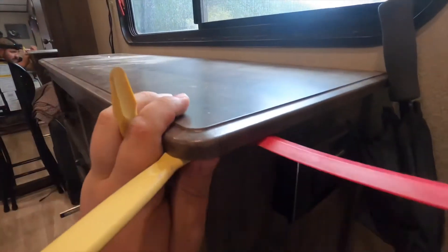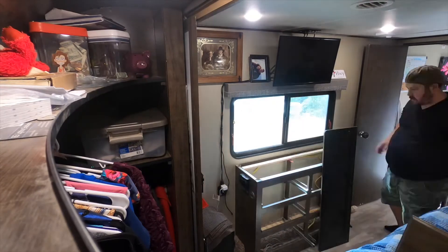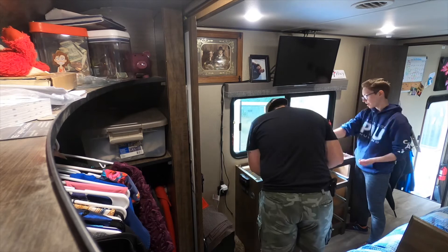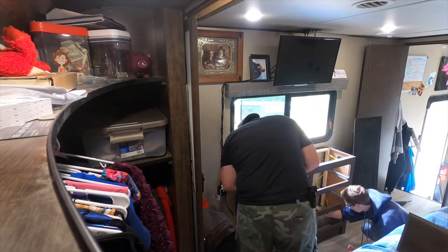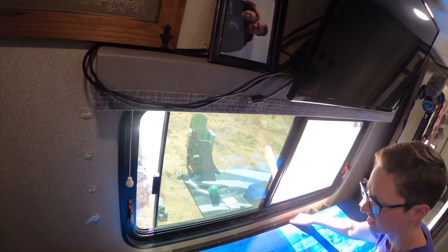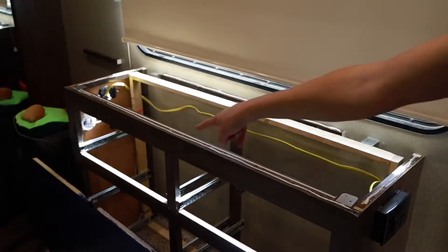Now the fun part begins — putting this desk together. The first thing I did was take off the old desktop. I wasn't sure exactly what this would entail since I'd never taken one off before, but I'm very thankful they only used long staples instead of glue. After you have the old top off, remove all the staples remaining because you won't be able to put the new top down flat. I used my Dremel with a grinder head to get all the staples off — it took maybe five minutes. Then I placed the new desktop to check fit, moved one of the supports out to the outer edge for more support, and put the brackets on, then glued and screwed the new desktop onto the desk.